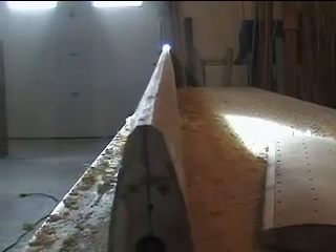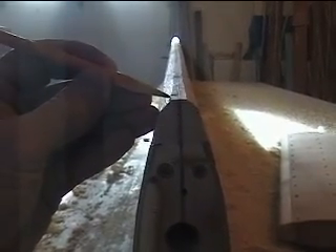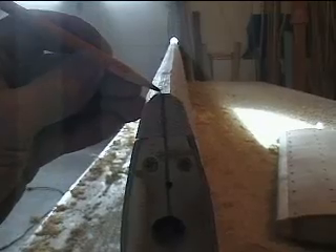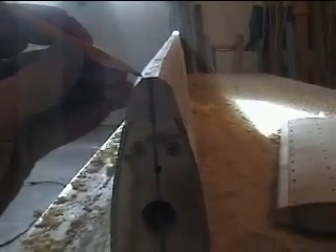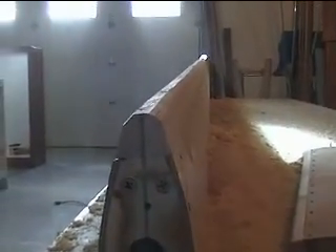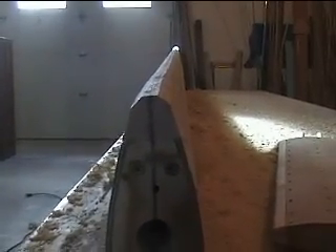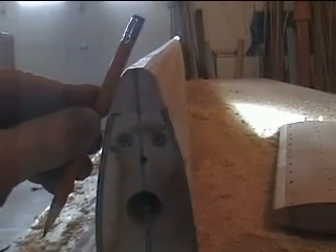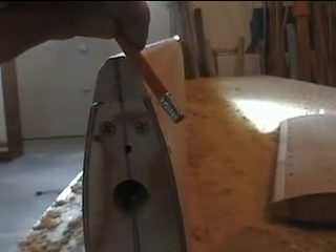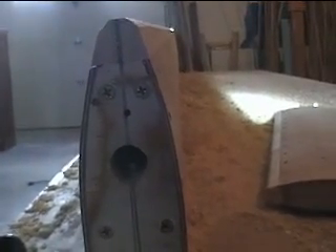Pretty much got the sides beveled a little bit. There's the corner of the bevel here at the center line. What I'm trying to accomplish is to get from here to here uniform with the other side — all the way down as it tapers. My next cut will be at an angle in between these two faces, and I'll just slowly work it down.